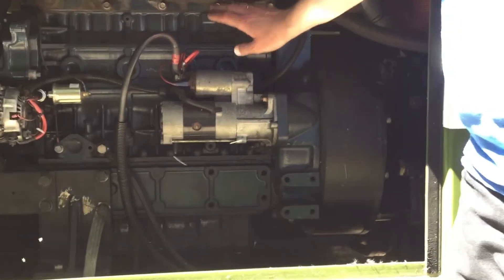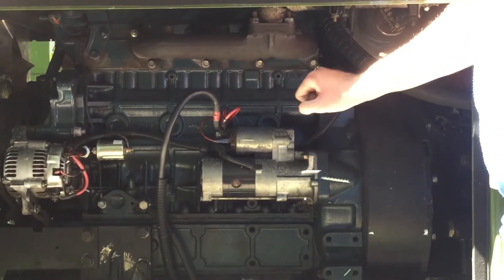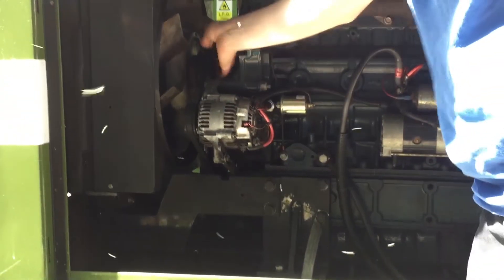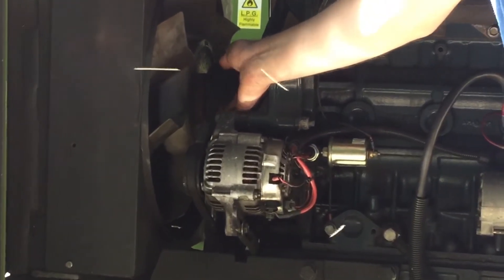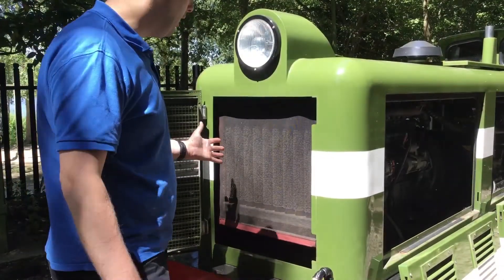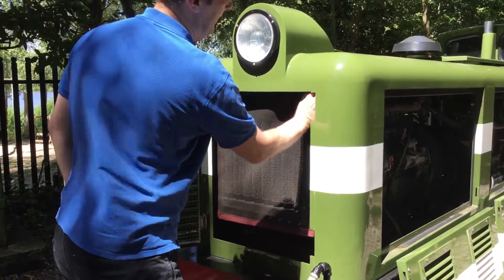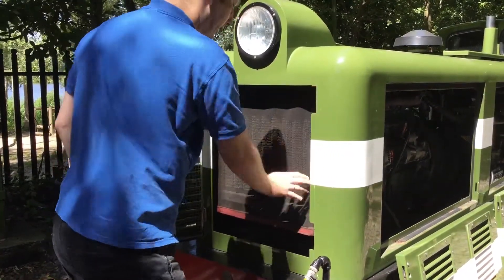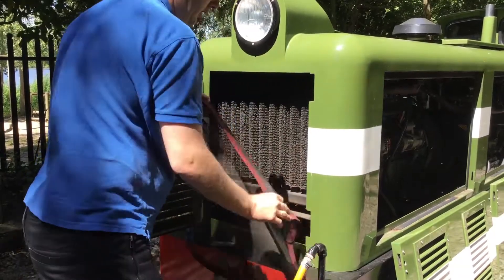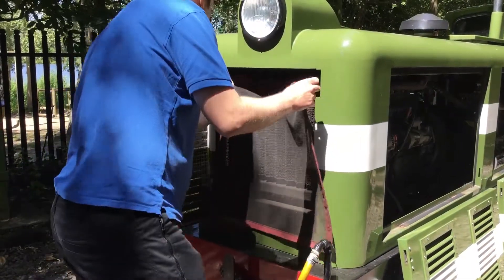Moving on to the second bay — this is where the engine and gearbox are: a Kubota diesel engine, 3.3 litre, 60 horsepower. Check the starter motor connections are not loose, check the alternator connections are not loose, check the fan belt is tight with no fraying — a little bit of movement is fine, but too loose or too tight is wrong — and also that all the blades are there on the fan itself. At the back of the loco is the dust filter in front of the radiator and the transmission cooler. Take the filter screen off by undoing the four little cords at the ends. If it was really dirty you'd flap it out, make sure it's clean, have a look inside, then put it back. That stops any dust and debris blocking up the radiators or the cooler.